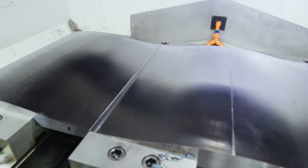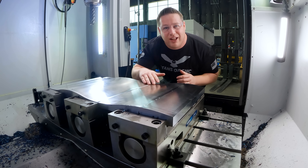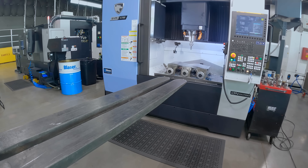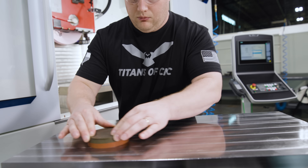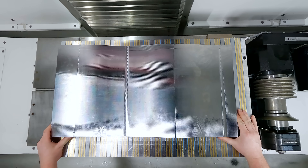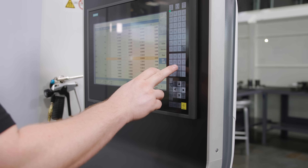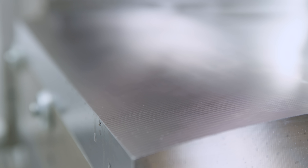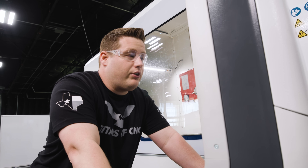Op 3 is complete, our wave is roughed in. Now it's time to go over to the Blohm Planomat XT and surface grind this wave to a perfect finish. But it's not following the profile — the code is right, cutter comp is in there, but it's not compensating the wheel like it's supposed to. I've pretty much tried everything I know to try. We probably should listen next time they tell us we can't do something.